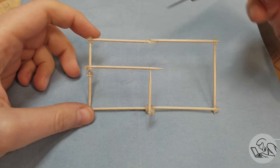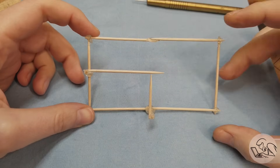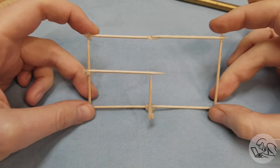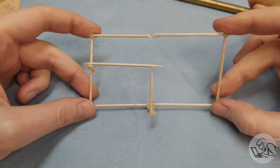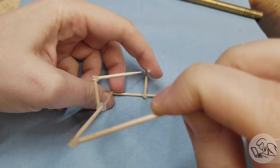Here's a little arts and crafts project to demonstrate how twist in the ways creates taper. Here's our stock, and here's our little tool post. Watch what happens when I twist one end of the ways — pay attention to the distance between the tool and the stock. When I twist one end, you can see that the distance between the tool and the stock changes. So if the near side of the tailstock end is tilted down, the tool gets further away from the stock, and that end of the stock is going to be larger — the machine is going to turn a taper. This is obviously very exaggerated; we're talking about microscopic amounts of twist on the real machine.